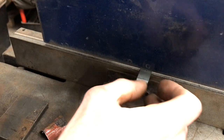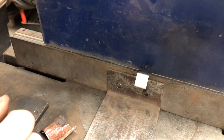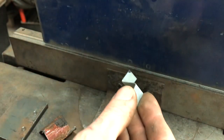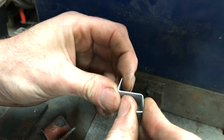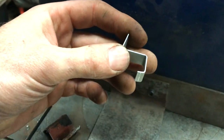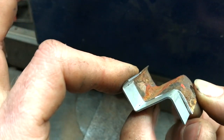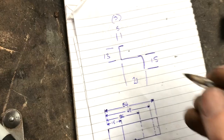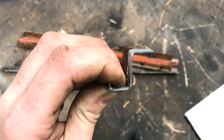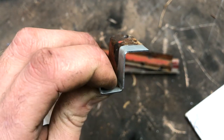There is actually a threaded stop on the press so you can fold at repeat angles, but I hadn't set it yet and was guessing, hence over-bending the last fold. On the first try it's pretty close but a bit short on one length, so I'm going to increase this by one millimetre. This affects the other succeeding fold positions. With the alteration made and another test sample compared, I'm happy with it now.